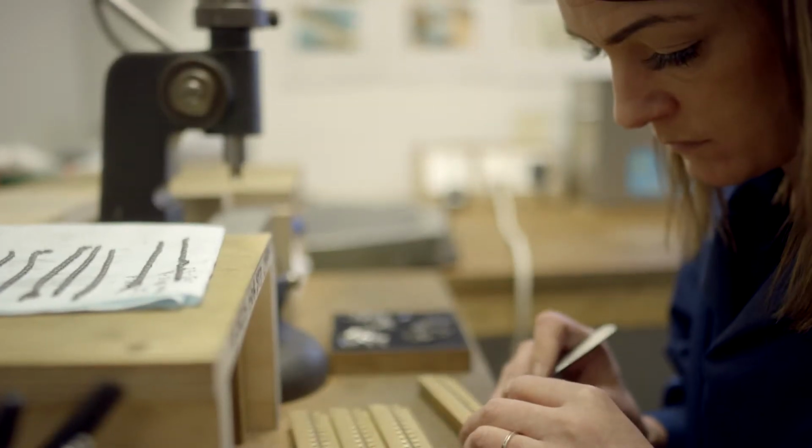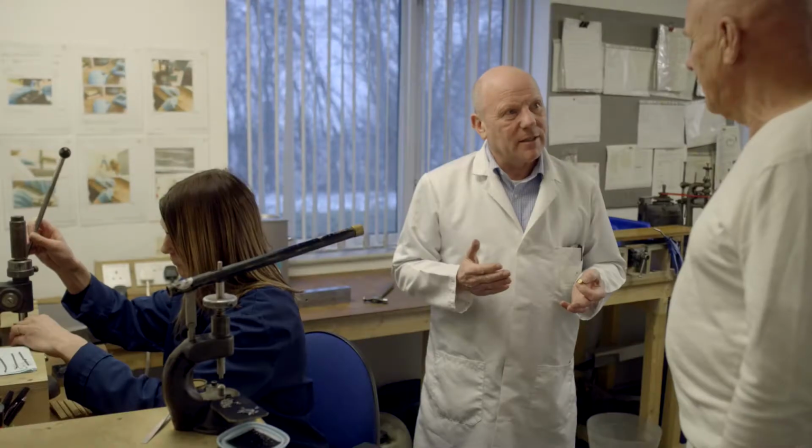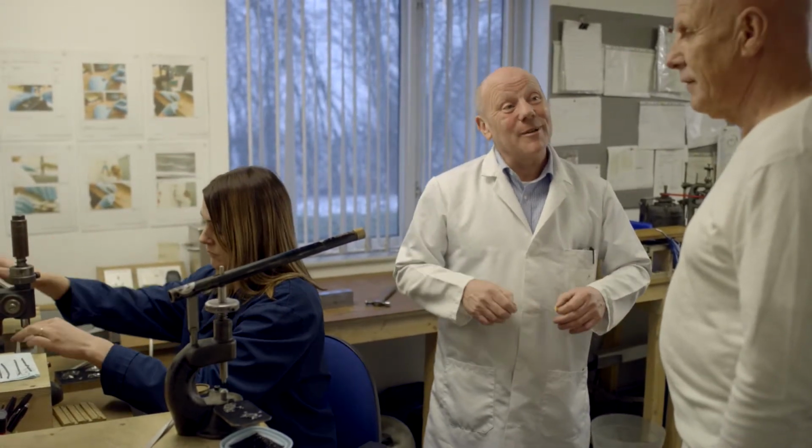and one of them is the manufacture of the fusee chains. Originally, the manufacture of this particular fusee chain was developed by a gentleman that used to work with the founder of the company, Mike Harding. The chains, we manufacture all the parts. The pins are made on a CNC lathe, but we stamp each link out on a manual press. Some of the links are hardened and tempered, and then Haley works for me 2.5 days a week, and she comes in and puts the chains together, which is quite an operation. But we love the old processes associated with clockmaking. This is probably 300 years old technology, and I'm pleased that we can keep it going.